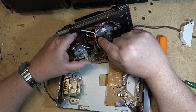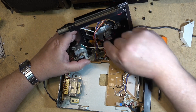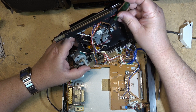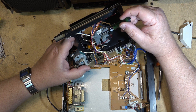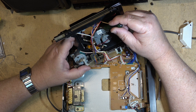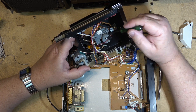The laser shines this way and the light reflects in through a mirror, then it comes in and goes up another mirror, then it comes back and reflects this way and goes to the photo detector — which is back here. So the laser is here and the photo detector is here. There's a mirror here and a mirror that goes across at an angle here — and that's the adjustment for it, which you don't ever, ever touch. Same with these ones; these will affect the alignment, you don't touch them. The laser shines here, hits a mirror, goes this way, hits another mirror, reflects up, signal comes back down through that mirror, reflects here and then passes through this mirror and gets to the detector. And that's where our problems are on this one — the mirrors themselves are clouded.